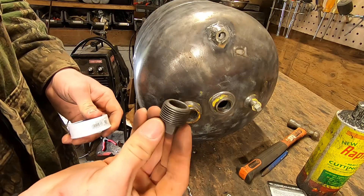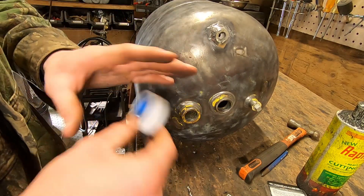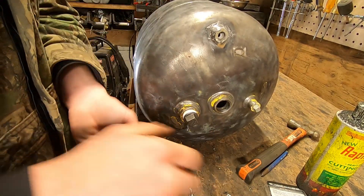At this point we're going to put in our three-quarter-inch plugs. Every single thread that goes into this tank, into the pressure switch, or really anything, is going to get PTFE tape — without that we probably won't get an airtight seal and we'll risk leaks.